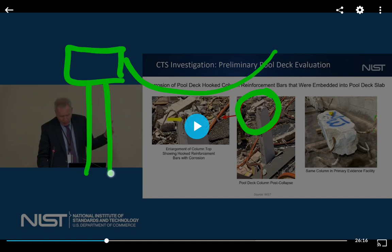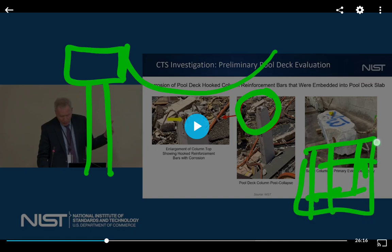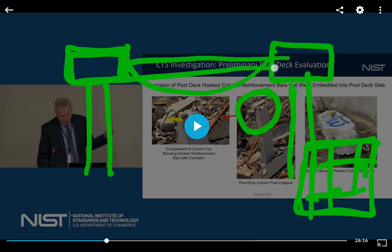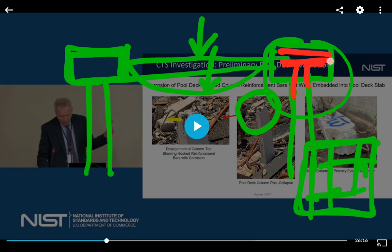Here's the column, and that critical shear zone — you know, like the nine-sixes and six-twelves, whatever they call them — over top of the head, those little boxes we see in the drawing. This is what it looks like. Then here's another column, and it has its version also, and in between there's some steel connecting the two of them together. As this deflects — and I'll show the deflection here — if it deflects, and this is of a great design, a superior design, their shear heads and the critical shear zone area, the rebar and reinforcement in that area, which is significant.